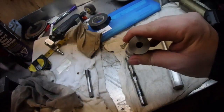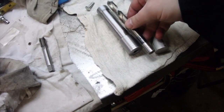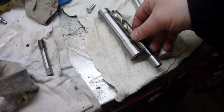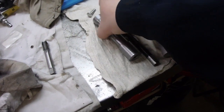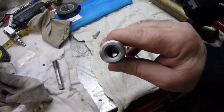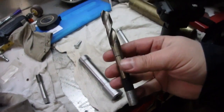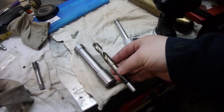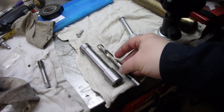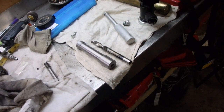Well I'm ready to start. We already got our hole through, so we're going to take the 9/16 drill bit. I marked it how far in I can go, which is basically going to take me to the edge of right there - because that's about as far as I want my piston to travel. I also modified my drill bit and ground it down right here so chips can get out, because we're going to go past where I'm going to go. Let's get this started - wish me luck.